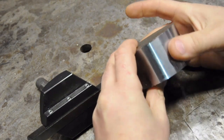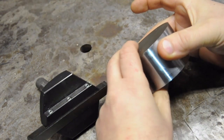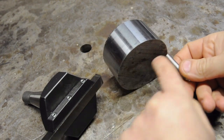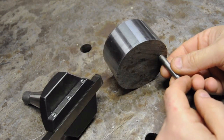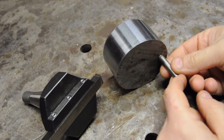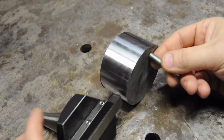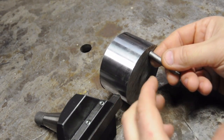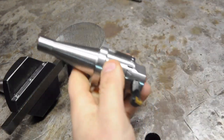If you don't like this style of fly cutter, there's a different style that's essentially a fixed diameter. Imagine a piece of chrome shaft with an arbor that goes into your mill — you'll see some that have holes drilled at different radii on the perimeter. You install a tool, maybe a broken high-speed steel bit or a resharpened carbide end mill, with a set screw in the side. You can't adjust the diameter, but if you make one large enough for 80% of the work you do, your bases might be covered.